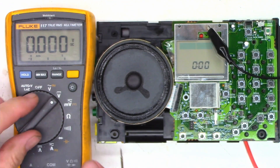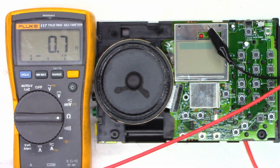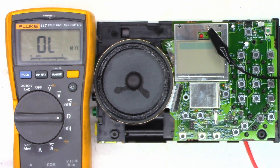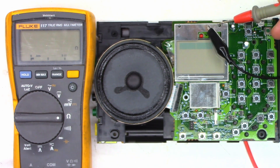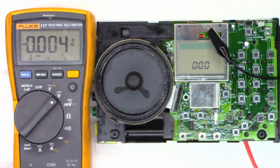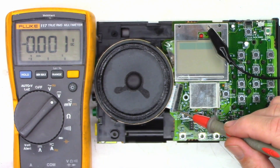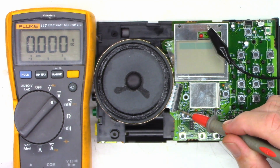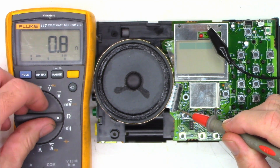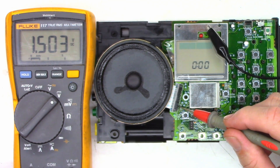I have my voltmeter connected. I'm going to put it on ohms and go all the way back to the power supply. I see 0.7–0.8 ohms — perfectly fine. With my negative lead attached I get the same thing, 0.8 ohms. So let's go to volts. The first thing I'm interested in is pin 14 right here — Micon three volts. I want to see what is on pin 14 of this ribbon connector. Pin 16 down here should be ground, verified at 0.7–0.8 ohms. So there's pin 14 — that should be 3.3 volts.